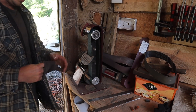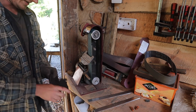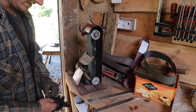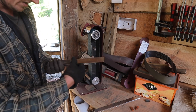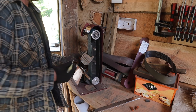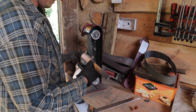This dirty old sleeper wood really causes a lot of blunting to the blades. Even though I brush down the outside and hose them off to keep the dust down, there are still bits of sand and little stones in the outside that destroy the blades. But that's okay - these blades came with the machine and they're already old, and I've got the ability to sharpen them. I use this Robert Sorby Pro Edge belt sander and it's excellent - really pleased with it.